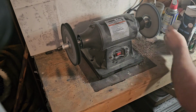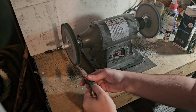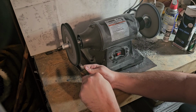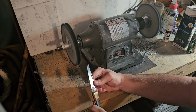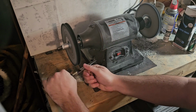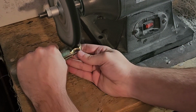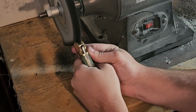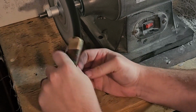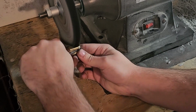It's a pretty important part, I think, in the process when you're doing a knife itself, because if the stone cannot take the polish, you have to be very careful about how you polish up those brass bolsters. And it could really ruin your stone if it's not the right polish. You know, it could take some luster and some shine off of it. Fortunately for us, it seems like the Sonoran Sunrise takes very well to the ZAM and the 3M. I am pleasantly surprised with how it turned out, and I can't wait for you to see it, to be honest.